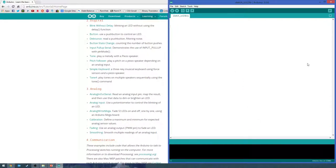Basically how you would start an array is kind of the same as any integer value. Let's say we make an array for the color blue, even though we know really it's just 255 for the blue. So we have our int blue, and to make sure you say it's an array, you add those square brackets. Then you do the same thing where you set it equal to something. Whatever you set it equal to has to be in curly braces, with commas in between. So for blue, we know it has no red, no green, but it has 255 blue in it, like we did in our last project.